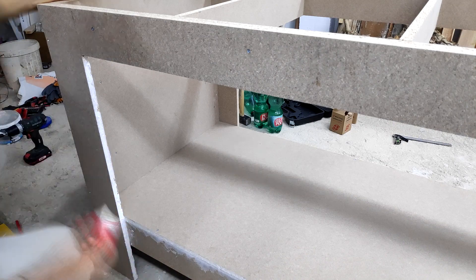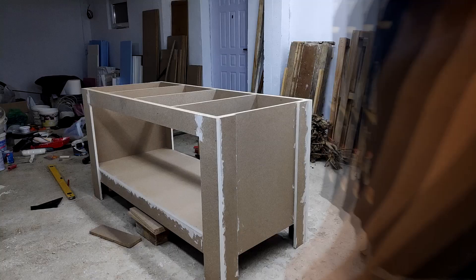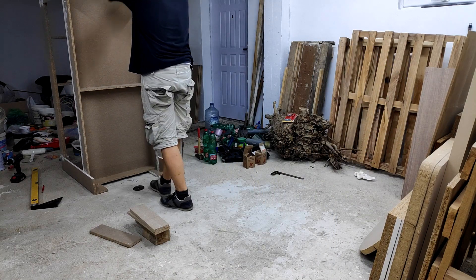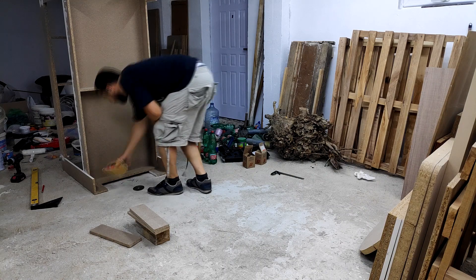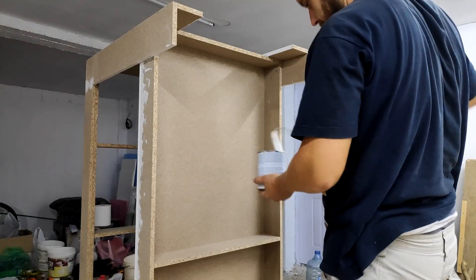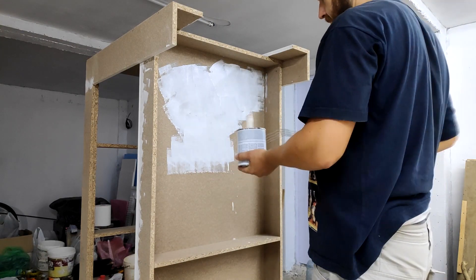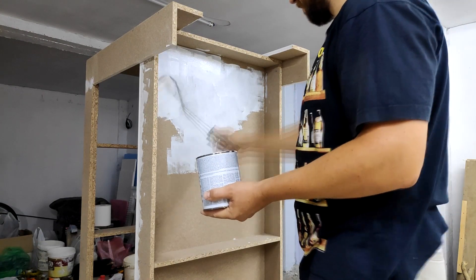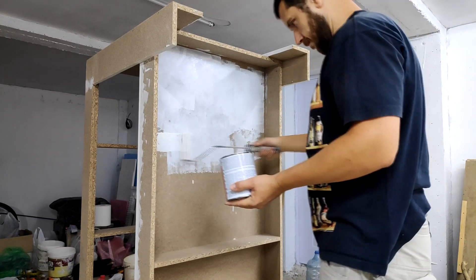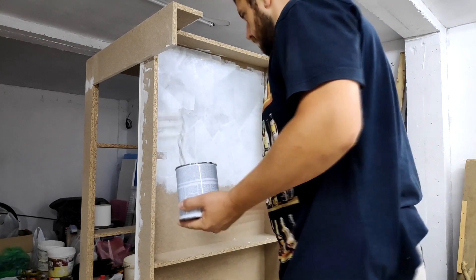It is crucial to mention that I did not bother to hide any of the screws I've used to assemble the workbench. The reason for it is that they will be painted over later and since this is a workshop piece it does not need to be pretty. Additionally I have some plans to upgrade it in the future with some extra features so I might need to drill or cut somewhere and I wanted to be able to remove any screws that are in the way. When the filler was dry I used 120 grit sandpaper on a sanding block to quickly knock off any of the high spots left from the filler, and after wiping the entire table with a cloth I flipped the table upright and added a layer of white primer paint on the bottom.